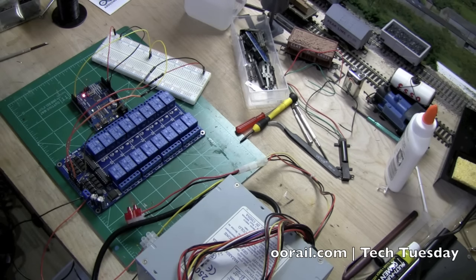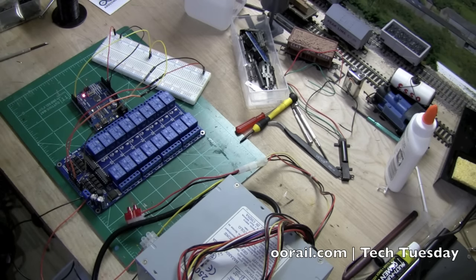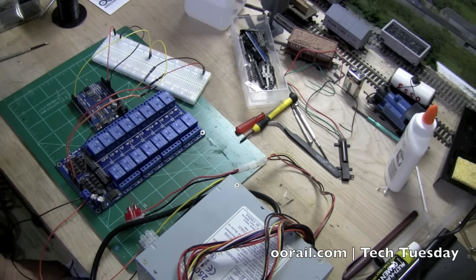So you heard that click. Now the way our code is set up it's going to take quite a while. So now we know that this one is relay 9 — counting across: 1, 2, 3, 4, 5, 6, 7, 8, this is obviously 9, 10, 11, 12, 13, 14, 15, 16. So what we're going to do next is wire up pins 7, 8, and 9, and it should drive those other relays. We're going to kill power to it and go ahead and wire up the other ones.